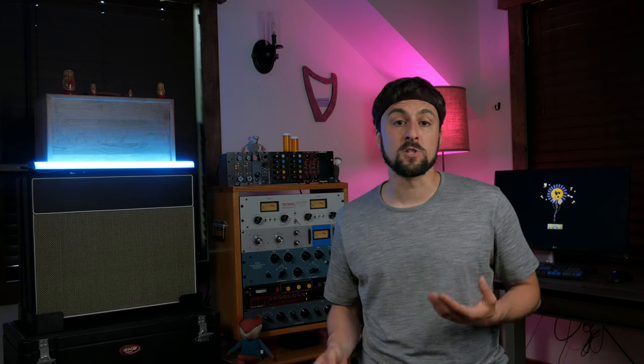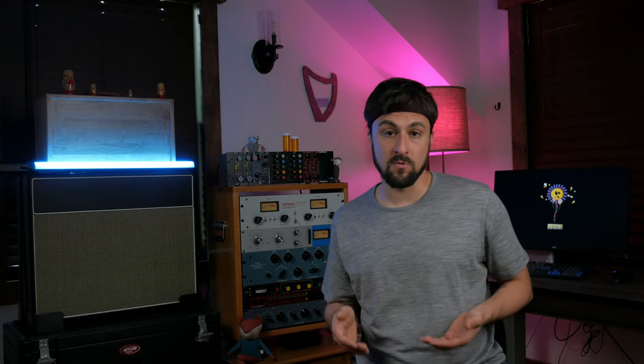Whichever wiring scheme you choose, the ground switch serves no purpose and has no impact on your tone. The hole this switch is mounted in, however, can be used for a number of different mods. My plan is to put a three-way negative feedback switch here at some point. This would make the amp a bit more versatile, providing options for more grit and cleaner cleans. When I put this in, I'll be sure to make a video on it.